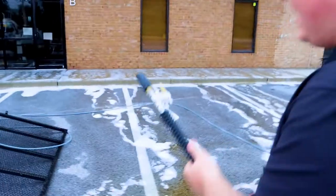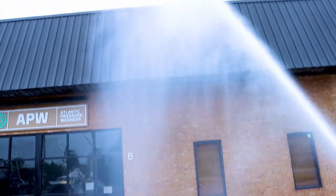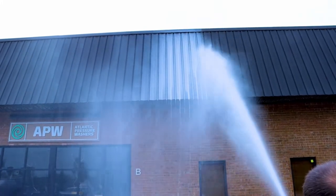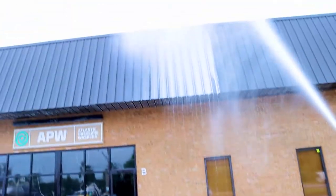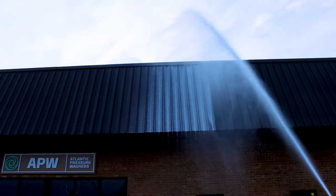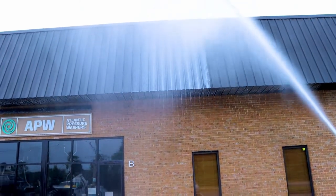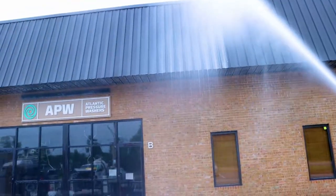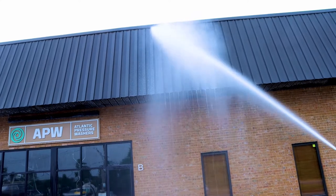One more quick look at our J-rod — we're going to see the difference between our M5 twist and our shooter tip. The shooter tip gives a very clean concentrated bead. The reason we have the shooter tip on here is that it shoots further every single time, giving you a little more distance. I'm easily clearing one of the two-and-a-half story commercial building without even trying, at very low pressure — it's basically just throwing soap up there. Once the soap flushes out of our line we're going to begin rinsing, then I'll switch back to our M5 twist.